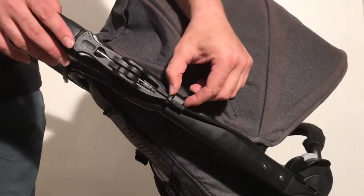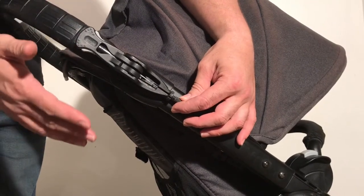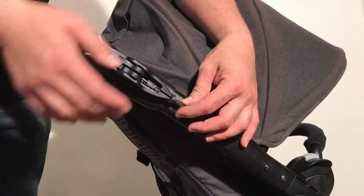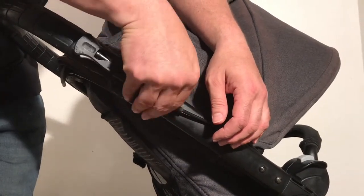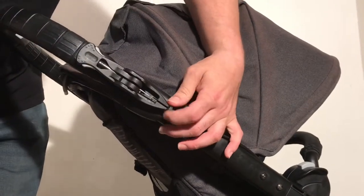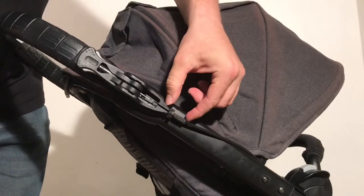At the moment it's in a middle position, but if I wanted the pins to stick out a bit further — if they're not sticking out far enough to brake the wheels — then I would loosen up the washer on the bottom first and then screw it in tighter so that it extends further out.